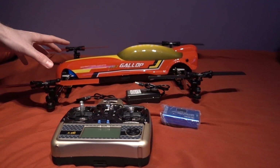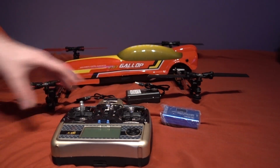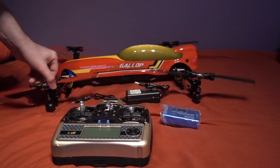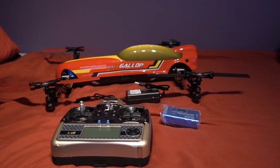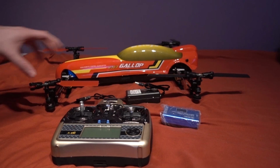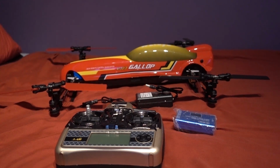But it's not like a helicopter in the conventional way, because a helicopter also changes the angle. But when it comes to the changing of the direction of the aircraft, it then works more like a quadcopter. However, it doesn't change the speed of each one of these because it can't. Look, that's all connected to the same motor, so each one of these can't run at different speeds, but it can run at a slightly different pitch, meaning that it sort of simulates a motor going faster or slower by having more or less pitch. And then it's got a very clever flight controller in the middle to deal with all that.